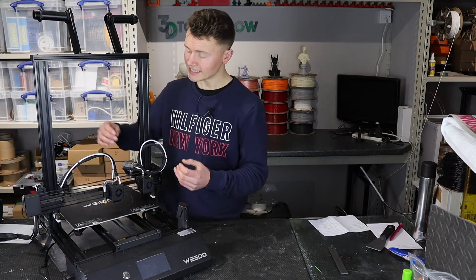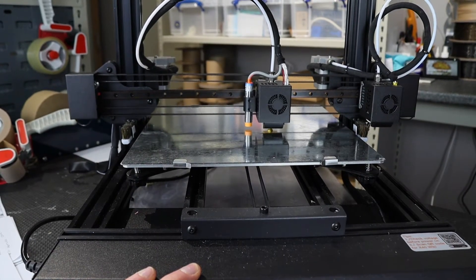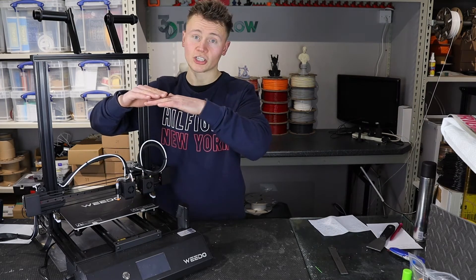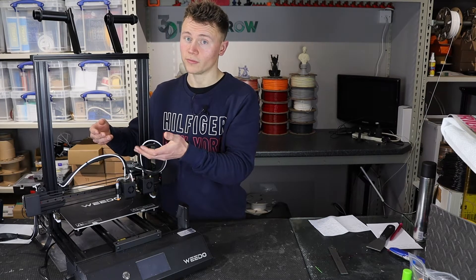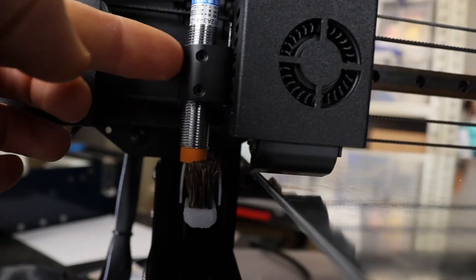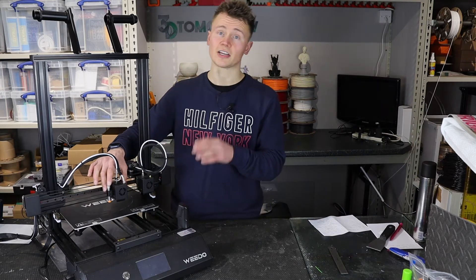The third thing on my pros list is the magnetic Z probe. It's on the list not just because it works quite reliably, but more importantly it's very easy to move it up and down if you wish to adjust the point at which it triggers. If you move it so that the base of the probe is closer to the tip of the nozzle, it will trigger earlier and your printer will move less far down. That gives you a little bit more flexibility with different thicknesses of beds. You've got two grub screws in the side of the magnetic probe — when released, they allow you to move it up and down and tighten it again. Really easy to do; I like that implementation.